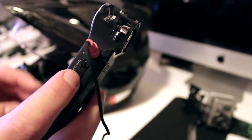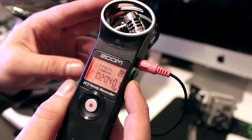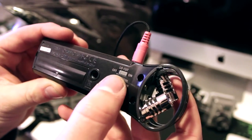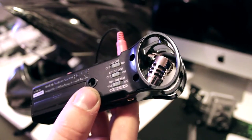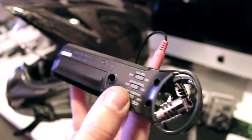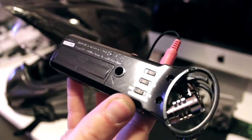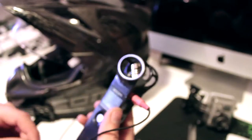At the moment, it's got the volume inputs on the side — you can adjust them like so. I've got it set at 21, which is about the sweet spot I've found. You've also got these little dials on the side: low cut — I've actually got that on because it cuts out the wind noise really effectively. There's also an auto level; I leave that off because I like to do things manually. And you can also set the bit rate down the bottom, which is pretty helpful — high quality audio or MP3 for longer recordings.